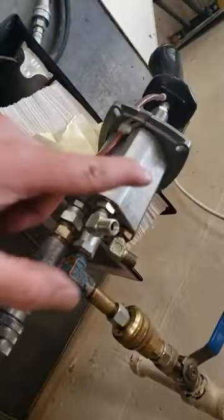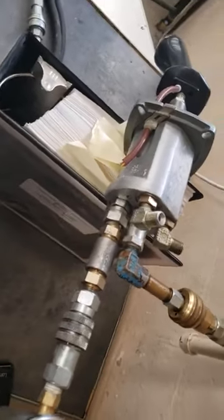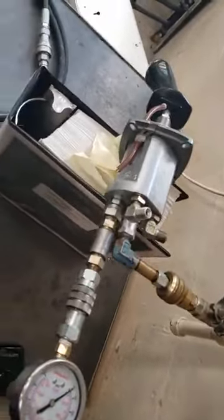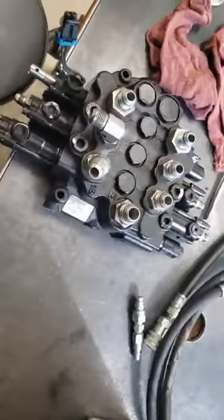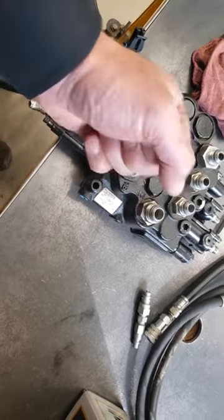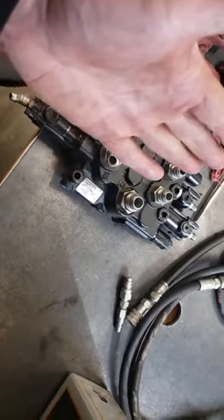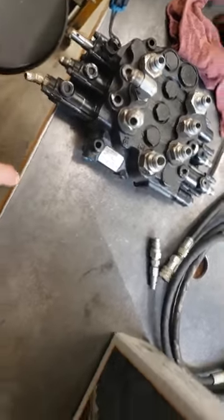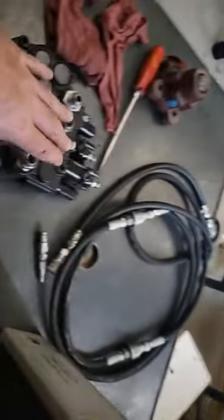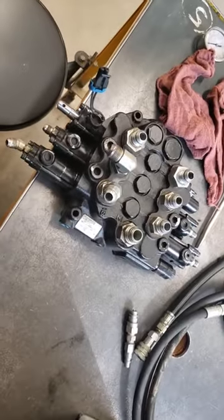The only time you really get oil flowing out to tank from this valve is when you're letting go of the control handles — that's when the centering spring does its job and pushes oil out. That drain is important. If this valve is 50 feet away from the cab, the centering spring has work to do to push that oil all the way through the line, especially in cold weather. If you operate a function and let go of the handle, the centering spring may not be able to push that thick molasses oil back to the cab fast enough, and you might get an implement that doesn't want to stop until the spring can finally push that oil through the line.